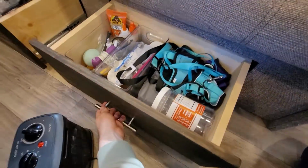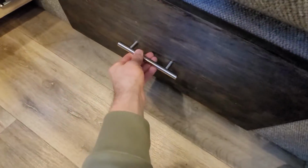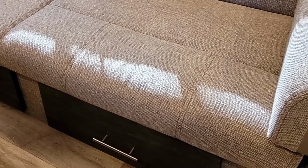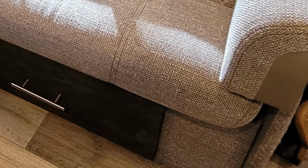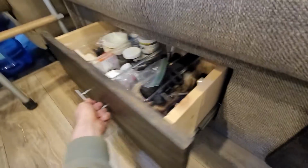Next came the most complicated part of the job, the drawer slides. The slides had to solve three problems. One, there had to be enough clearance to allow for a drawer catch to be installed underneath, because even though the drawer slides themselves have a catch mechanism, it's important to have that extra security so no drawers are swinging open while driving. Two, it must be installed flush with the mating surface, that is, the back of the face of the drawer must just touch the face of the drawer opening, so the drawer rail catch mechanism works, and also so that nothing sticks out. Finally, the height had to be just right so nothing is scraping.